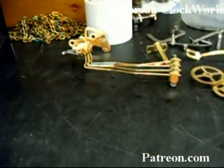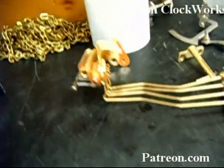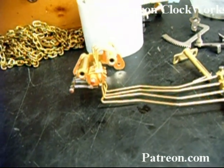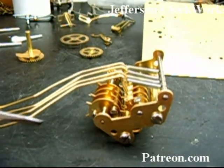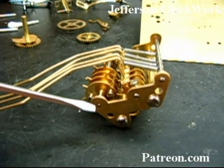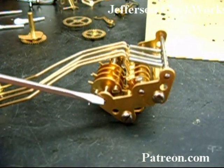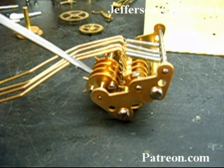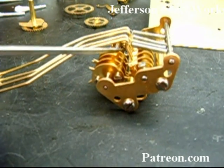Here are some of the other components. I decided to throw in the chime hammers — it still has to be taken apart, but it eliminated a lot of hand polishing. Here's the chime assembly all put back together, and I just wanted to cover lubrication. You can put some heavy mainspring oil, either light or medium, on this area as well as the other area for the chime barrel.